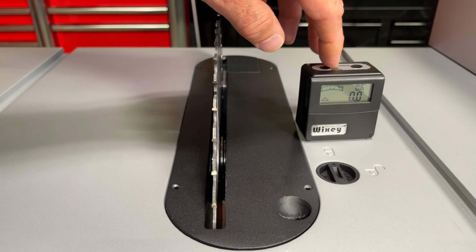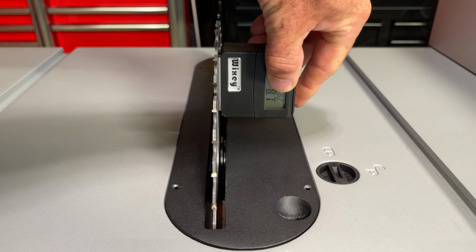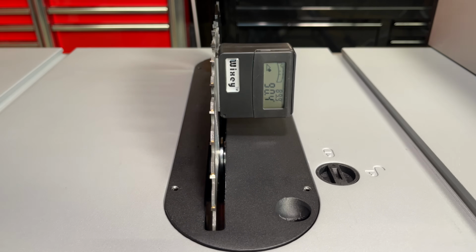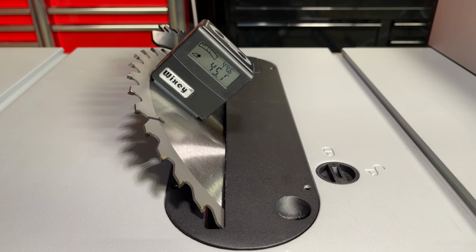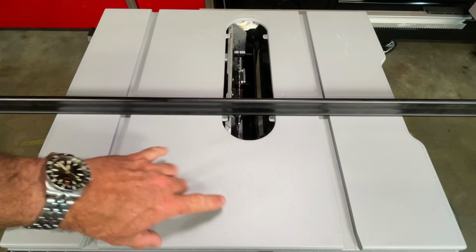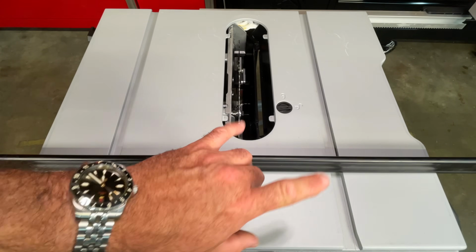So despite the sweet machining error on the table here, let's check our stops just for fun, and we'll see how flat the table is, and then we'll move on. 0.4 off on the 90 side, and we'll just be lazy and bevel to 45. Almost. Not bad. Well, we've hit a new low. It's like 10 thou everywhere. Off by 10 thou pretty much everywhere.